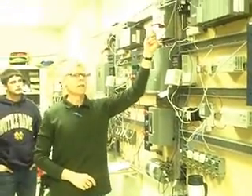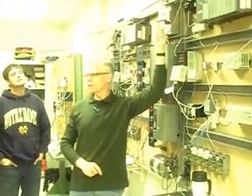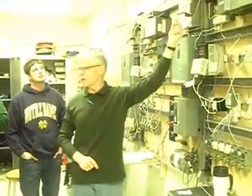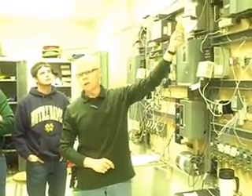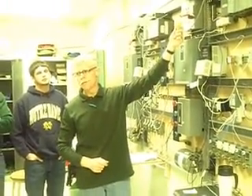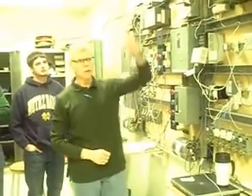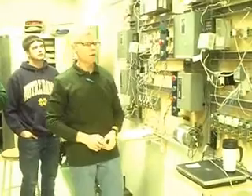We've got locks on them, so we're trying to follow the lockout tagout procedure. So if you're working on something, it should be turned off and locked out and you should have the key. In here it's pretty obvious, but in normal circumstances, if you're working up a tower somewhere or a long ways from what you're working on, you want to make sure it's locked out and that you're protected.